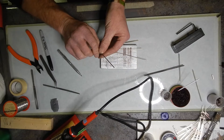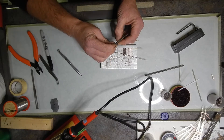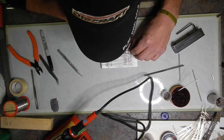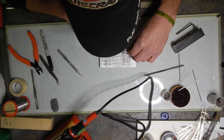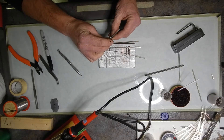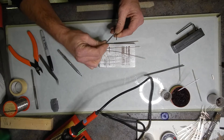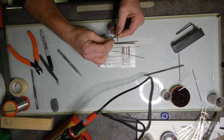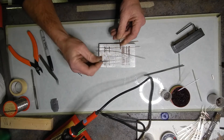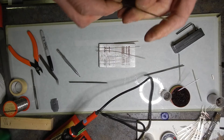What that's going to allow you to do is create a bend. Let's do this one first. Take the file and file this piece right here down. Double check to make sure you got it right where you want it — double checking the mark because even though you have a fine sharpie, you can still not get quite as accurate. All you're going to do is take away the base of the rail, holding it at an angle.